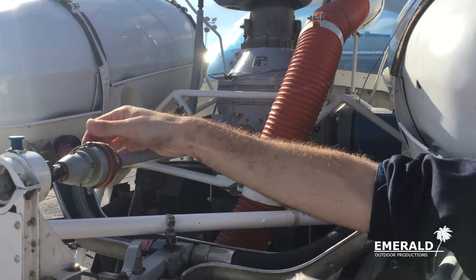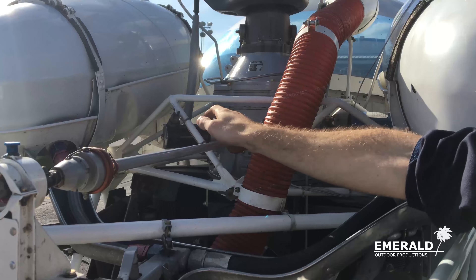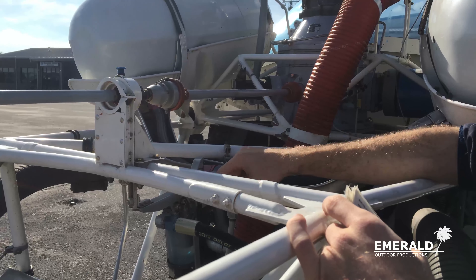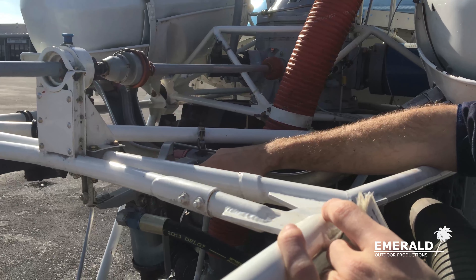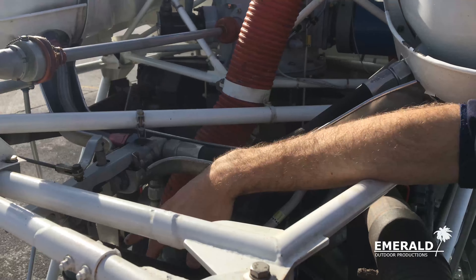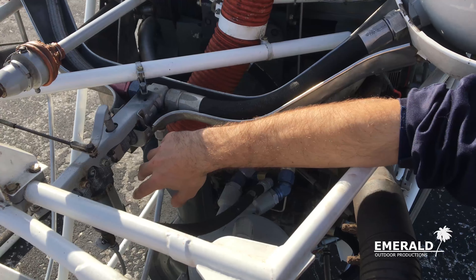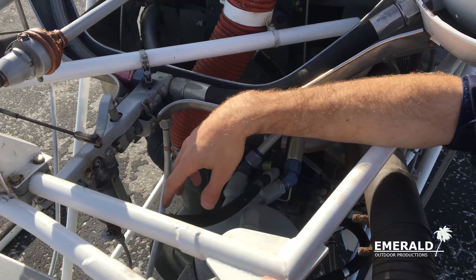We're looking at the short shaft on the right engine side. We check that the baffle is still on and connected, that all bolts are secured. We check the valve covers — there's an oil line that drains back from the valve covers, attached by fittings you shouldn't be able to rotate by hand. Make sure they're tight, as that's usually where you start getting oil leakage.